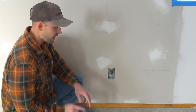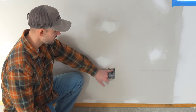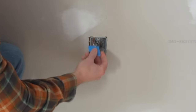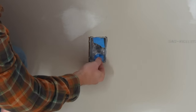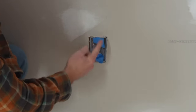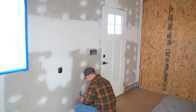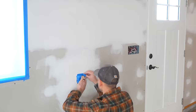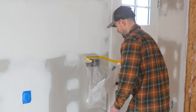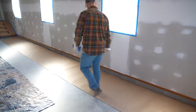After putting the baggie in, I like to cover up the screw holes of the electrical boxes because too much paint can prevent the screw from going into the hole. I just take blue painters tape and place it right over those screw holes. You also want to cover things like the 50-amp receptacle — place painters tape right over it — along with the panel box and any light switches, taping plastic around the switch boxes as well.